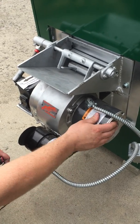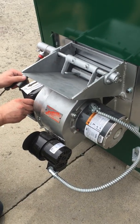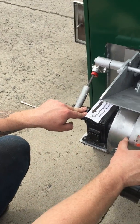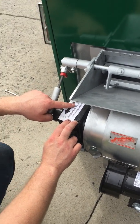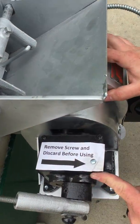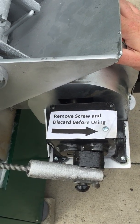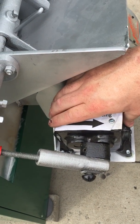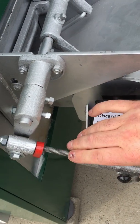What this motor does is it's going to drive your gear motor, which drives the drive arm to feed the coal. It also blows air underneath the grates. If you notice here, it says 'remove screw and discard before using.' We use this screw to seal the top of the gear motor because there is gear oil inside there, and this stops it from leaking out during shipment. The primary motor drives the gears inside and in return spins the fitting to the unit.